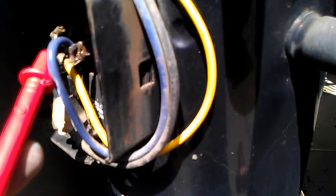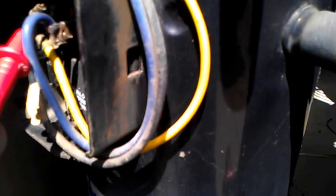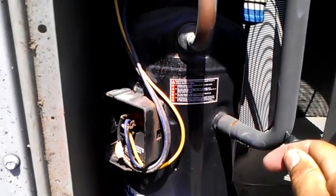And this other one here as well. So that's what you have — the run winding and the T1 winding on this three and a half ton compressor are shorted, and the compressor needs to be replaced.